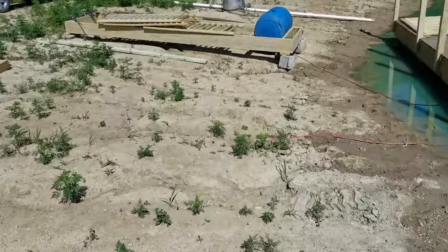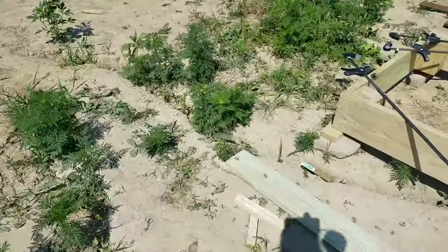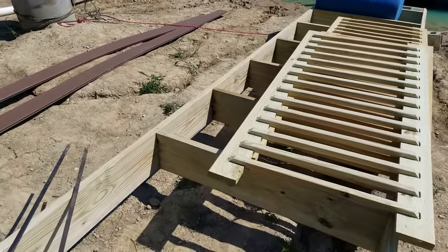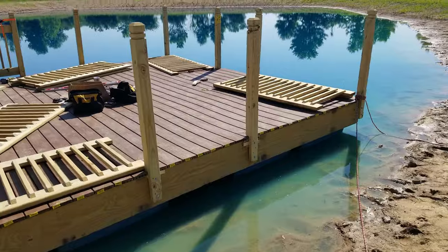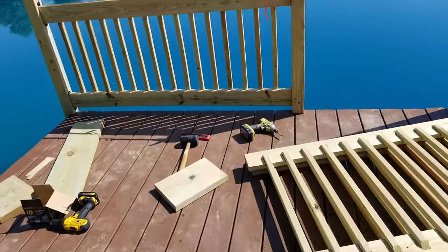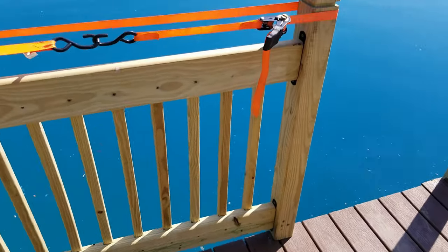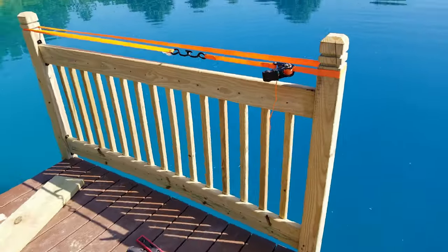Here is what I accomplished while my truck was charging on the generator last night. I got supports in all the way up to about here — had to run out and get some more lumber this morning, which is always fun during a pandemic. I actually built this gangway with slots for every 22 inches so I could truly put barrels in every slot if we ever wanted to and kind of turn this into a second floating barge, maybe a fishing barge. Out here setting the rails now — let me show you the hardware. It's pretty slick. You put two screws on the inside this way and then up on top, just do it on all four corners. Pro tip — if you're a little out of plumb with your posts, a ratchet strap can tighten them up, and it's very helpful when you're working by yourself.